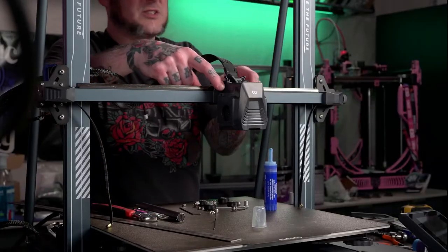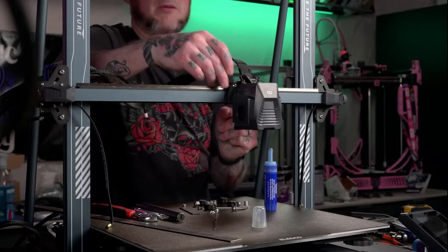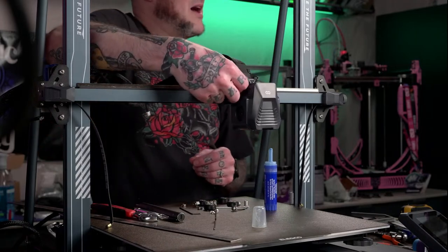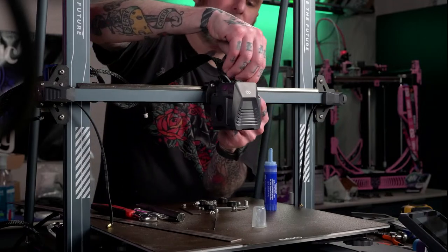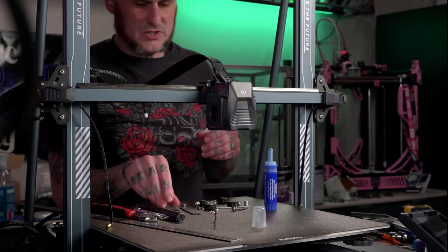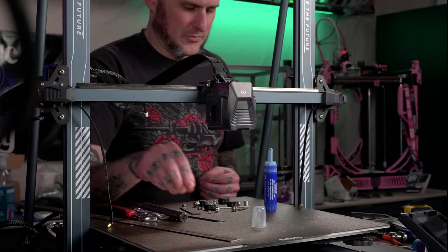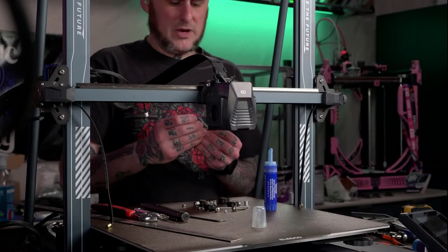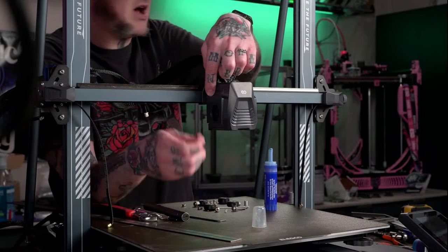All right, there's these two screws here, one here, and I can't see the other one, but it's the same location on the other side, that mount this to this carriage plate with an M3x5. And I just have to put a couple of screws in the fan housing to install that, and we have installed the X-axis rail, and the belt, and retensioned the belt. But, you know, minor things. Minor things.